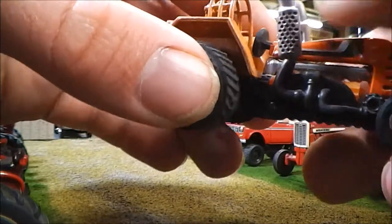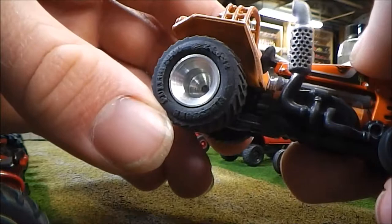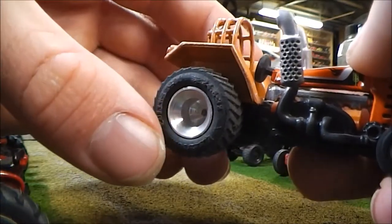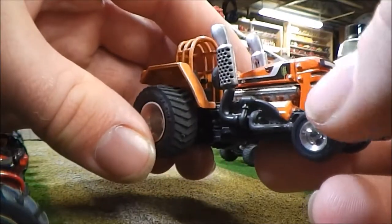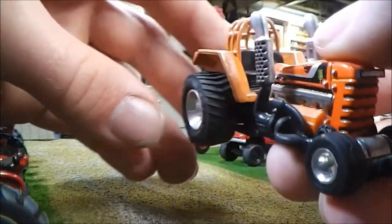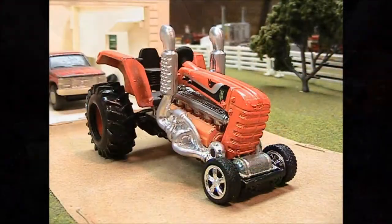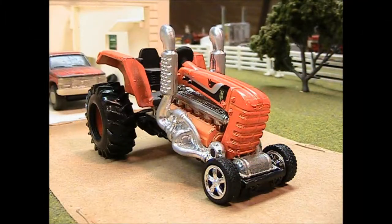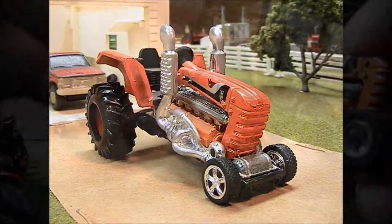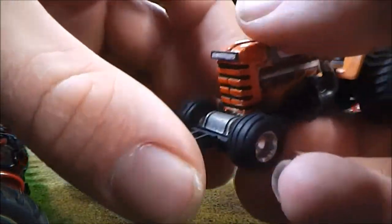Another thing — the wheels. The wheels had to be scratch built. These are made by turning aluminum on the lathe for the rims, and the tires are custom rubber castings as well. They definitely look better than what was on there before. I did try putting just regular tractor tires on this, but it again just didn't look right, so I went with the actual pulling tires, and they really lifted the look.